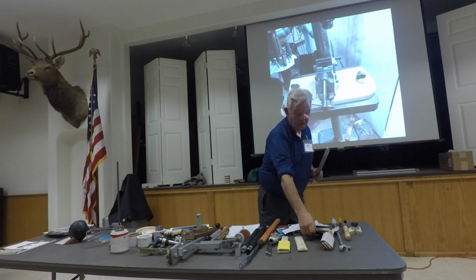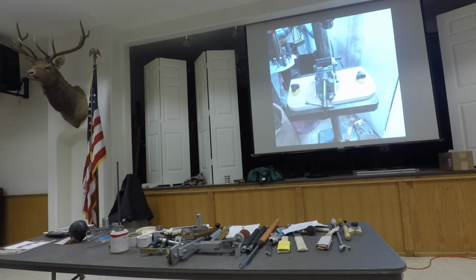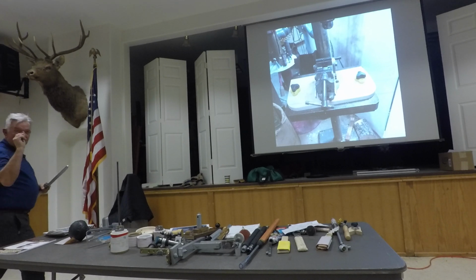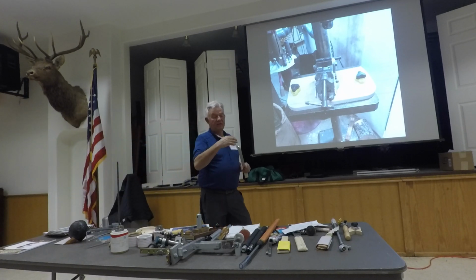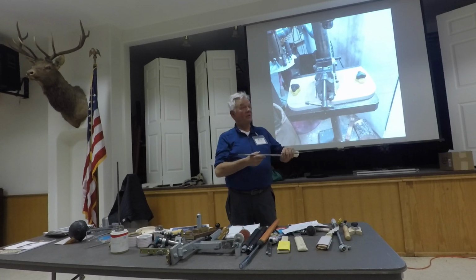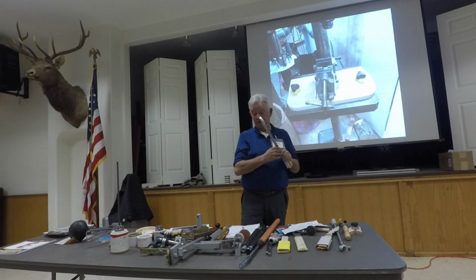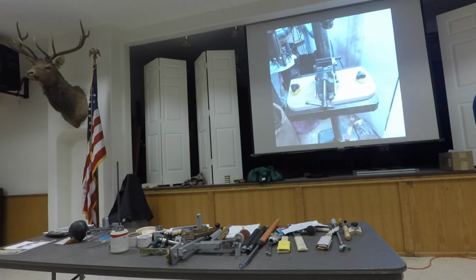And part of the trick of that, Makita makes these really super thin cutting blades. If you're cutting something that's really thin, the metal doesn't get hot and it goes through a lot quicker. If you're using a regular chop saw for metal that's usually thicker, you'll turn this thing cherry red, and then you've altered the tempering on it. So those little discs are just marvelous. I've put a little bit of the curve in, and then with the ceramic belt from A&H, with that little belt sander, you can shape this right in, and that's how I actually sharpen my scrapers, just as a regular, everyday way to work on it.